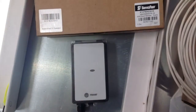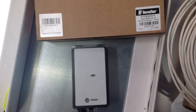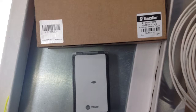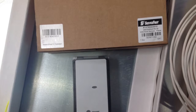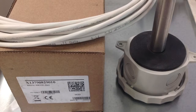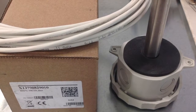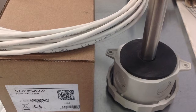The first close-up is of the CO2 sensor. This is placed in the return air ductwork and is used by the control panel to modulate the amount of outside air coming into the mixing box. As we reduce outside air, we increase return air and vice versa, via the damper linkage. This is a close-up of the relative humidity sensor, also placed in the return air duct — it is for information purposes only and shows up on the display screen to monitor relative humidity in the space.